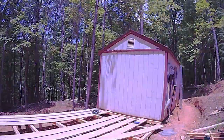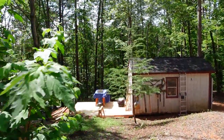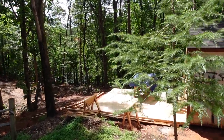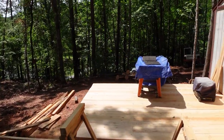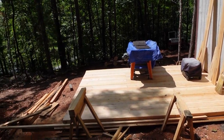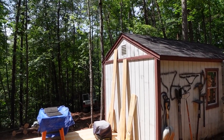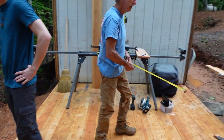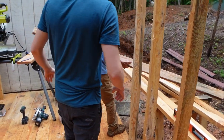Now we're going to be working on the walls. I need about 30 2x4s - I gotta go cut those to build the walls. I need 2x6 for the rafters, a 2x8 for the header up there, and we'll start putting that together. Actually it's 92 and 3/8s. So we need something 92. So we got a board. Now we want to make sure we've got a square end - that's not exactly square. So to make it square, we take a speed square, take the saw, hold the speed square, and square off our end. Very cool.